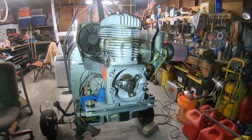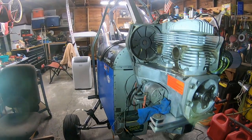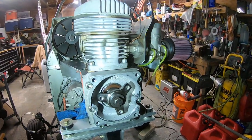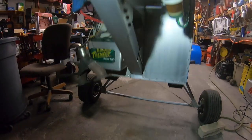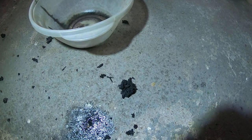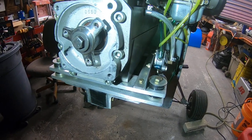What's missing off the front of the airplane is the G50 reduction gear drive. I just happened to notice, as I was pulling the manifold off of the engine, that I had some rubber debris building up around these bolts right here. You can see that rubber debris on the floor — just chewed up rubber.